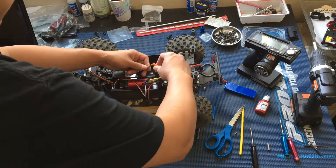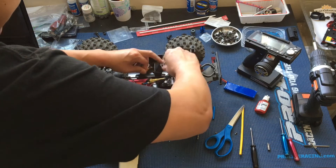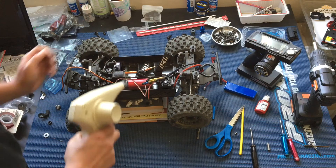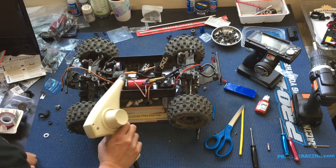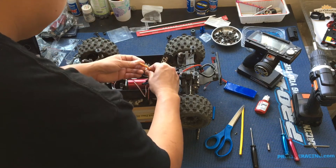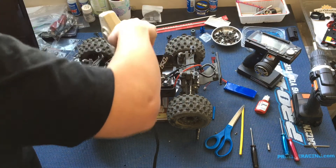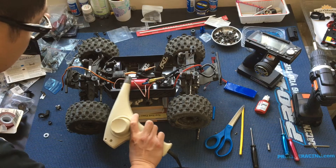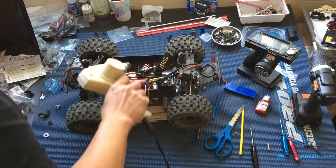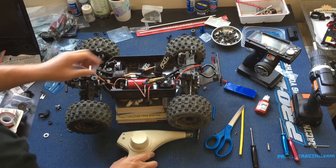I can actually even connect it here and shrink it, just so that I get the best possible fit. Actually I'm gonna take it off and do it so that the wire is straight — provide some strain relief too, which is nice. Sometimes as an engineer I tend to overthink things, but better to overthink than underthink. Just want to hit the heat there from all angles. There we go — we got the orange done.